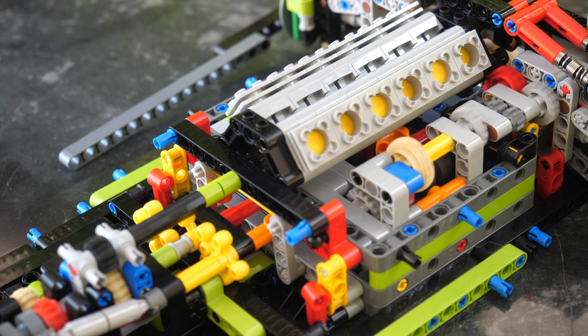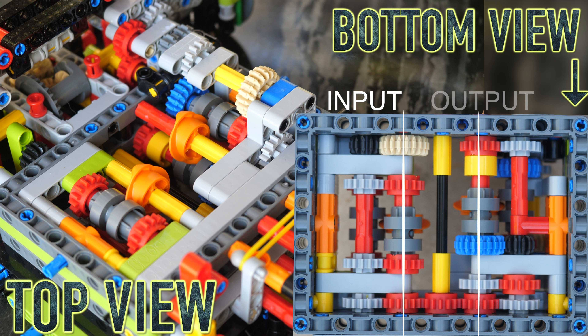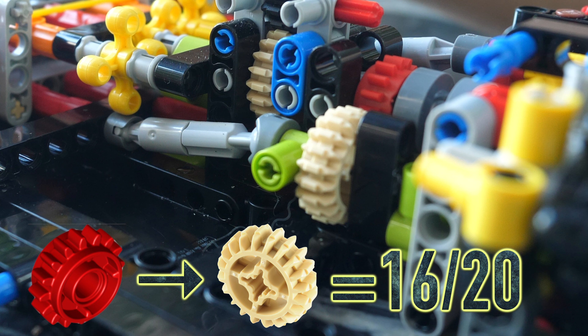You may be wondering how this all works, so I'm going to explain everything. I have both a top view and a bottom view — the right side of the bottom view is the same as the right side of the top view. There are two main axles you need to understand. This axle right over here is the input for the entire gearbox from the engine. This one over here is the output of the entire speed transmission gearbox. Right now we're on the first speed — the only two selectors engaged out of the four are the bottom two. The input axle has engaged into this gear, which is a one-to-one ratio, and these gears are transferring power to the right gearbox.